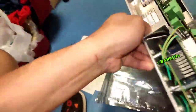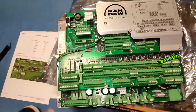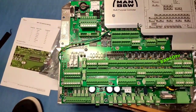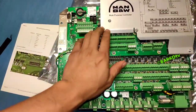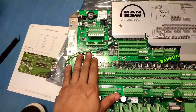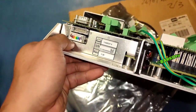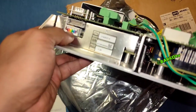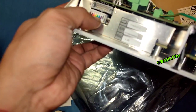Now let's start. When you install this unit — for example, this is a spare MPC whose board has been used previously at another location — it is necessary to force the MPC to update its software from the MOP. This is done by the following steps.